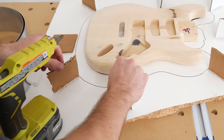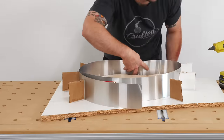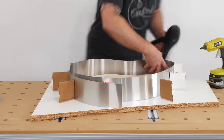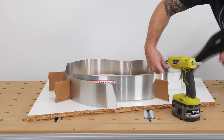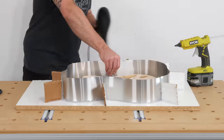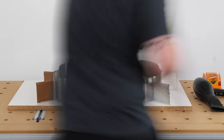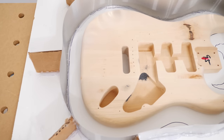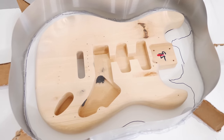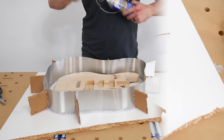After seeing me struggling with the hot glue, Ben's sister Jesse lent me her hairdryer, which I used to help the hot glue set up more quickly while adding the flashing — and this worked great. I used plenty of hot glue here as it not only provided structure for the sides of the form but also acted as the sealant around the bottom edges to keep the silicone from leaking out. Looking back, I should have tried to get the sides of the form a lot closer to the guitar body, as I had to use a lot more silicone than necessary because of the spacing.